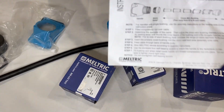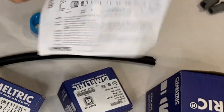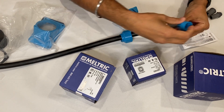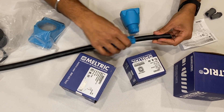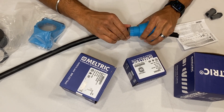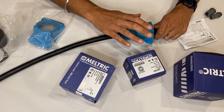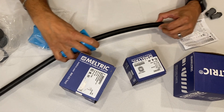The instructions give you a nice picture on how everything goes in order. Your compression nut is going to go in first, then your bushing, and finally the strain relief goes in. The bushing inserts into the strain relief, and then the strain relief fits into the handle and compresses in. When you're ready to tighten everything down, your compression nut basically screws right over. We're not ready to do that just yet because we need to do some stripping of the jacket.